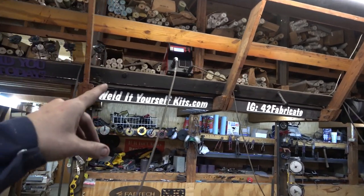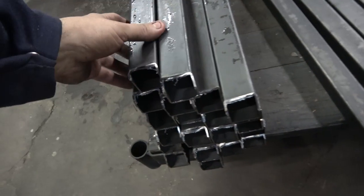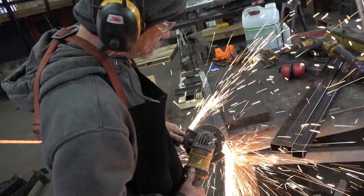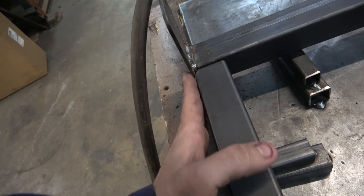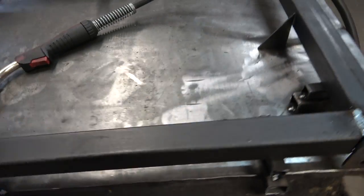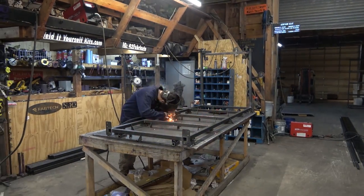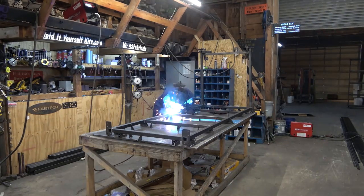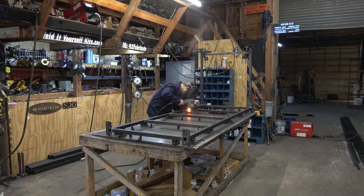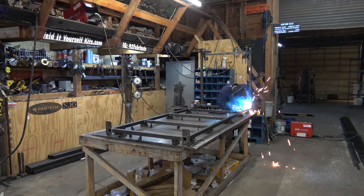What we did was stick the 200 — which has a 15-foot gun — up above and drop the gun down, routing the ground cable so I can run around the table with less chance of getting tangled. We've got to knock off the edges of these profiles so they'll slip right in around the joint. We want these basically flush to the plate so there's no gap, and a little bit of offset so that if there's a bend, it doesn't bind up the whole mechanism. For reference on this job: 70 24-foot-long sticks of inch-and-a-half square tube, 14-gauge wall, almost 30 pounds of 0.030 wire, basically a full cylinder of gas, and almost a full 4x8 sheet of 10-gauge for all the flanges.